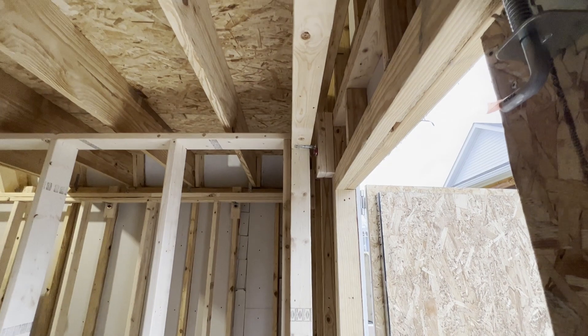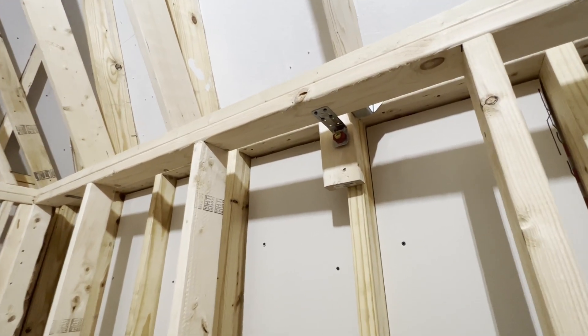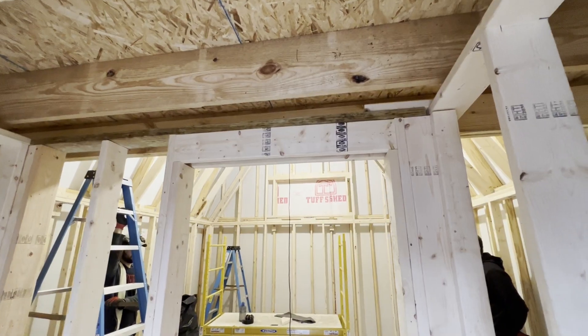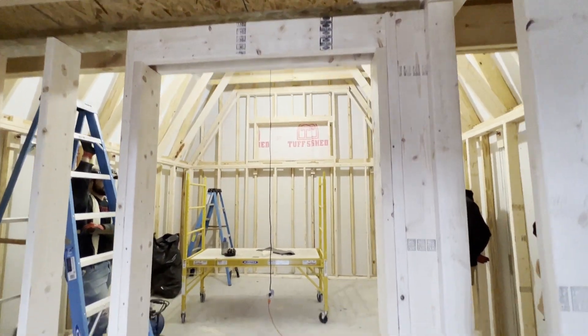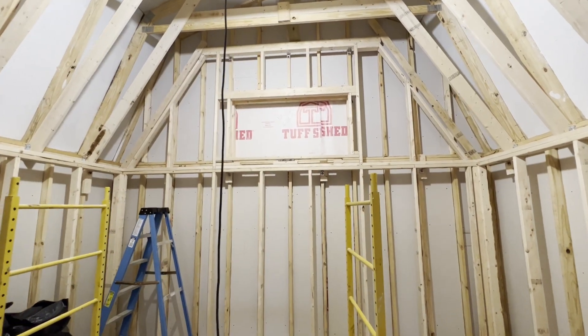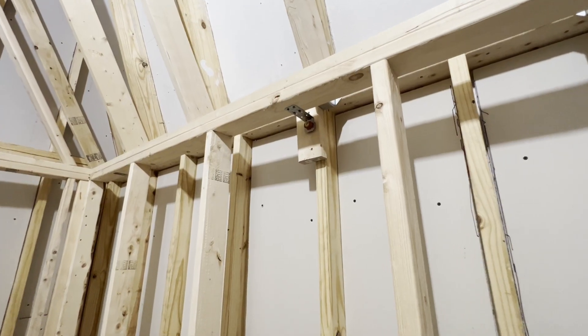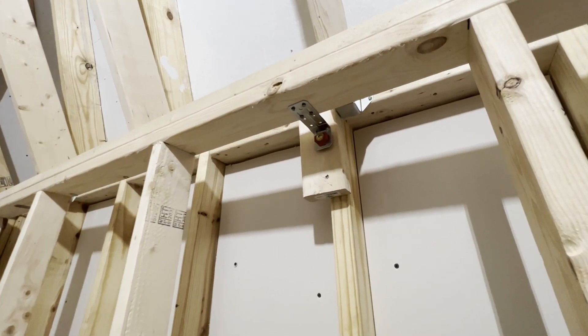An important aspect of the double wall system is sway bracing. This helps prevent the wall from swaying, especially if you have a heavy door on that wall. To connect the wall to the outside structure — usually a no-no in soundproofing — it's okay if you use specialty soundproofing clips. In this design we used the IB3 clips. Mason Industries sway bracing clips, like the Wick isolation clip, are also good and are probably higher quality than the IB3 clips.